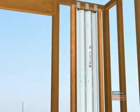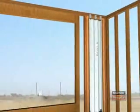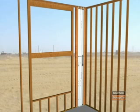Finally, place the minimum two 2x6 full height studs on each side with 10D nails at 16 inch on center. Understand that the designer determines the actual stud or post design based on out-of-plane wind loading. This is what the balloon framing should look like when it is properly installed on a concrete foundation.